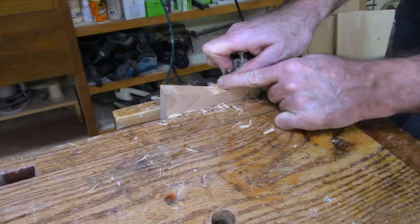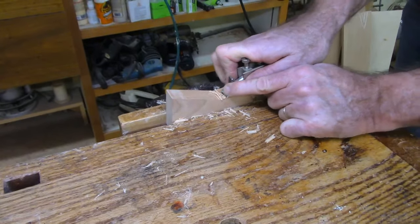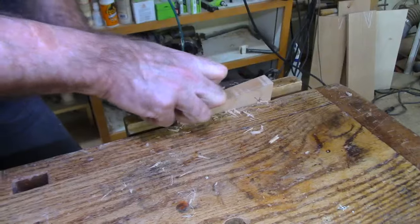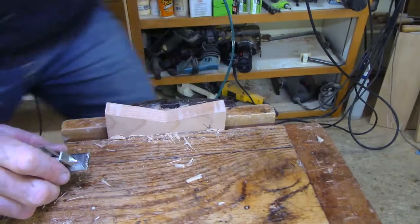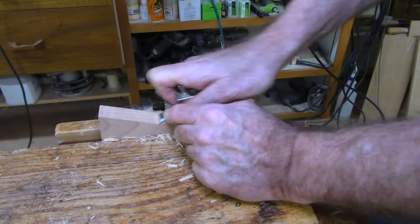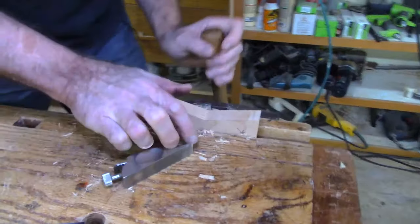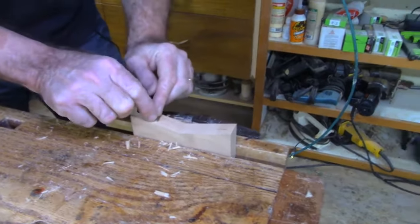If you put a bow tie on one side where the check is, might it not want to check on the opposite side? No, Lee, not that it's dry. It's now that it's dry. So that all happened with that log basically going from 35% moisture content down to, man, it's bone dry now. It's pretty stable now, especially being white pine, which is quite a stable wood to begin with.